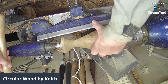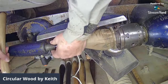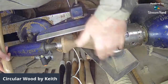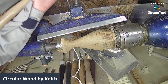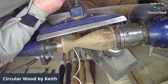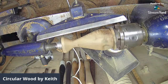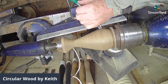Might be that the wood's just sucking it in. I mean, it needs to cure quite well before you put the second coat on, same between the second and third. So if you put five coats on, I would think you would probably be two days into that. If you're less than that, you need to be a little bit more patient, Ben, because they need to cure before you can do anything more with them. You can just keep adding to it, but it doesn't work if you don't let it cure properly.